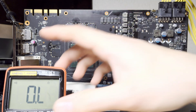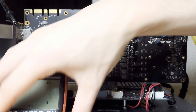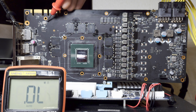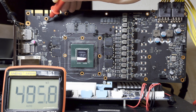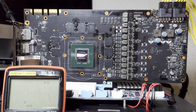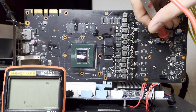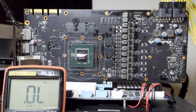We have no shorts in the base voltage rails. Now let's move over to resistance mode and check the resistances of all our other voltage rails. Let's check the first 5 volt rail - that's 9 kilohms and rising. Now let's check the second 5 volt rail. If you're wondering why there are two 5 volt rails, cards with lots of MOSFETs and power stages tend to have multiple 5 volt rails. We have more than 9 kilohms on both, so we're good.